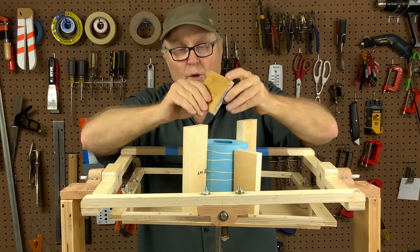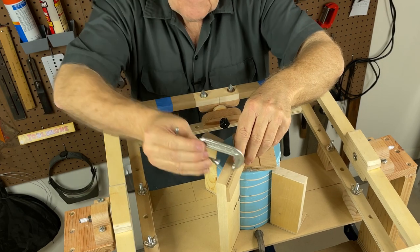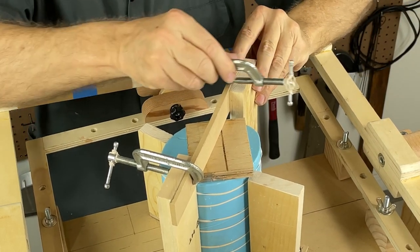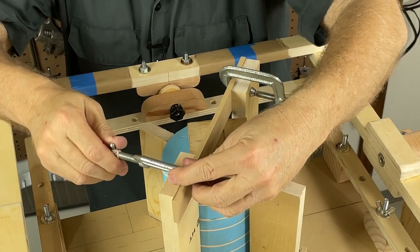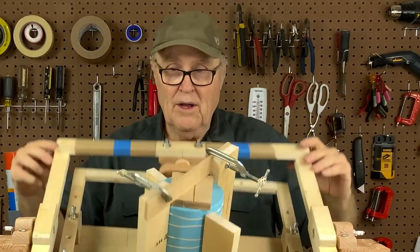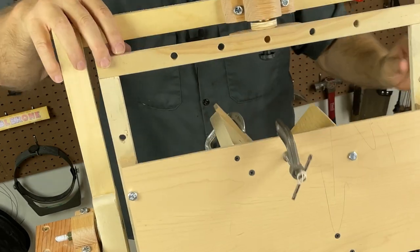To hold the piece from falling out of the mold once it's flipped over, I'm just using this piece of old flooring because it's got finish and spray release on it. The whole thing is held in place with a couple of c-clamps, which I can put on quickly after pouring the shot of resin. I put them on opposite sides — again, that's all about balance. I took two c-clamps on this side to help with counterbalance, so there's a little more weight here to offset the weight on the other side.